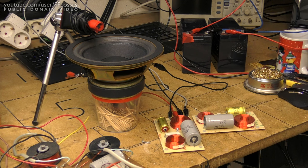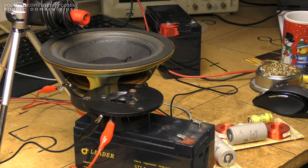Except our tweeters are 4 ohm rated, so that means we've got a much lower impedance in our tweeters than in our woofers. So we need to take a full system measurement and see if we're going to need to dampen our tweeters by putting a couple of power resistors in series with them, because I'm afraid we're going to have a massively bright speaker otherwise — since we'll be pumping a stupid amount of power into the tweeter compared to the woofer. And yes indeed, it's exactly as I feared — it is quite obvious that we have an entirely ear-raping experience in this speaker, so we need to dampen down this tweeter.